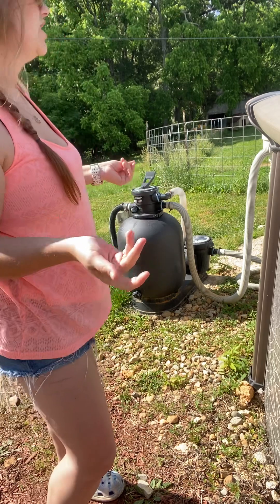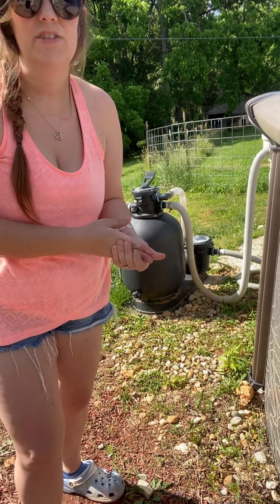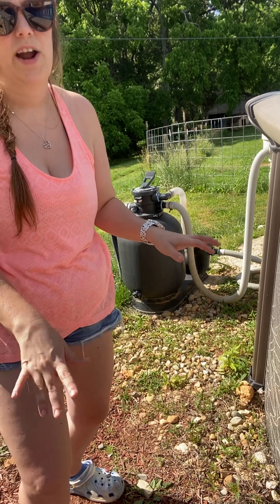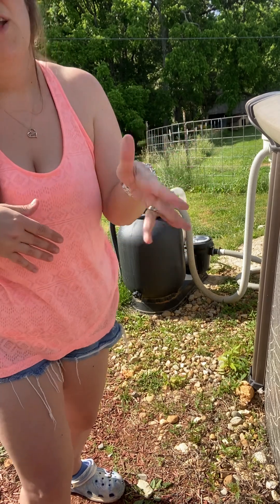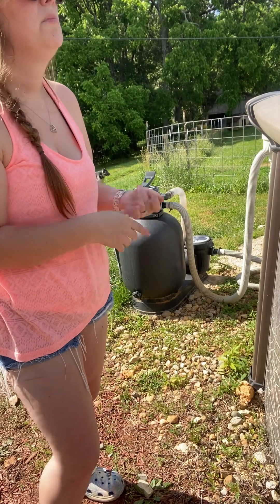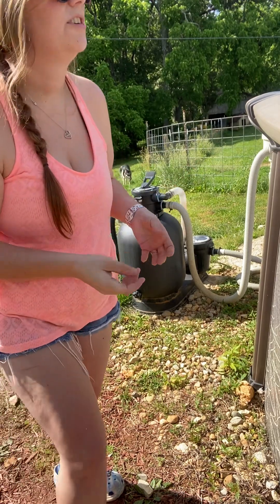Just a few tips and tricks — I'm going to let it sit after rinsing for a few minutes, let that sand settle down in the canister before I flip the power back on. That eliminates the sand going back into the pool. While that's doing that, I'm going to get my vacuum started too because I've got a little stuff in the bottom of the pool.